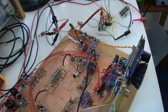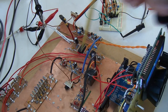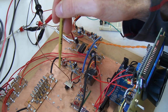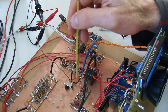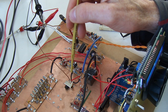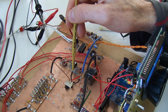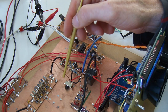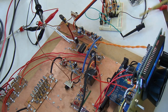What I have down here, maybe I can zoom up on a little bit, is a simple little switch, double pole, double throw switch. In the upper position, that varying AGC voltage is being applied to that 1K ohm resistor and then to the diode. In the other position, that's disconnected, and then these two black wires come into play, and that is shorting that junction directly to earth, so that emitter resistor is now shorted directly back to earth. In other words, the original configuration had flat out gain and no AGC. And the reason I had a switch there is that it allowed me to take various measurements and then plot them, which we'll look at.